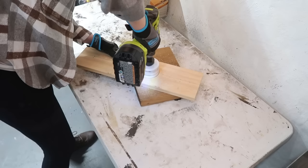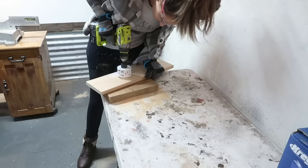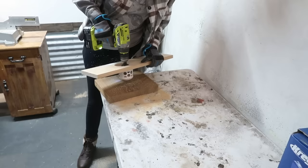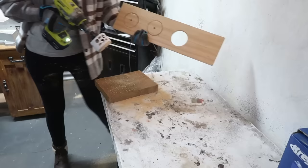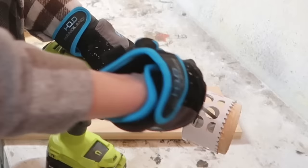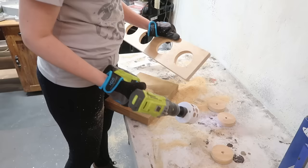If you're a little more seasoned and have a hole saw on hand, it's really easy to use — it just takes some patience. The drill bit is right in the middle — that's where you line up those marks we made earlier. Drill down until the drill bit goes through the other side of the board, then flip it over, put the drill bit back through that hole, and drill the rest of the hole out as you can see here. Take that right out of there and we have a hole in the middle of our board where we need it. Before moving on to the next hole, you need to pop the wood out of the hole saw — just take a screwdriver and it pops right out. Work your way down the board, cutting all four holes out.